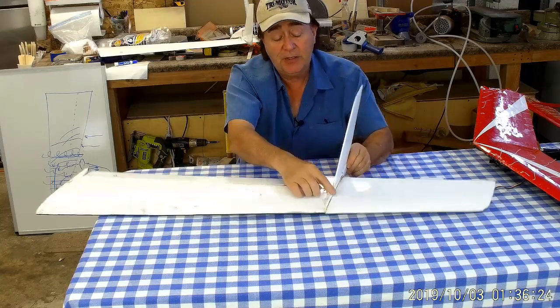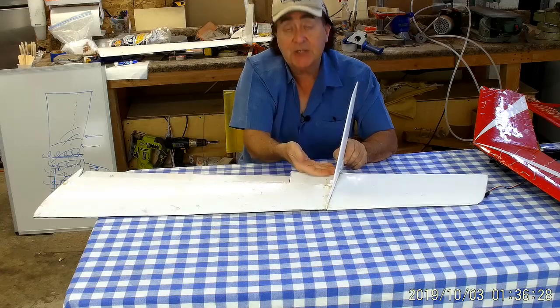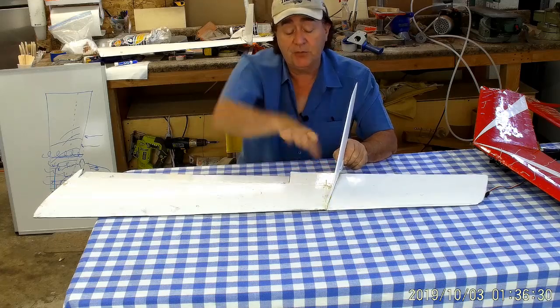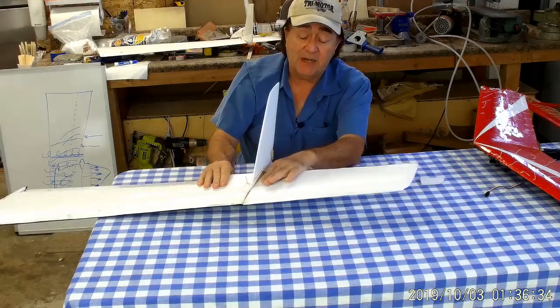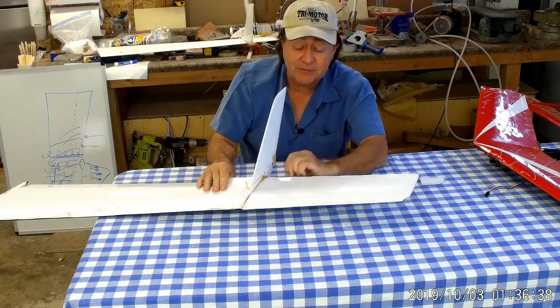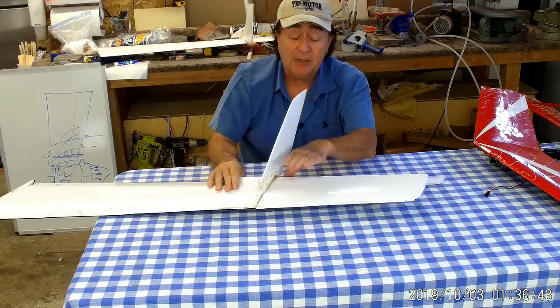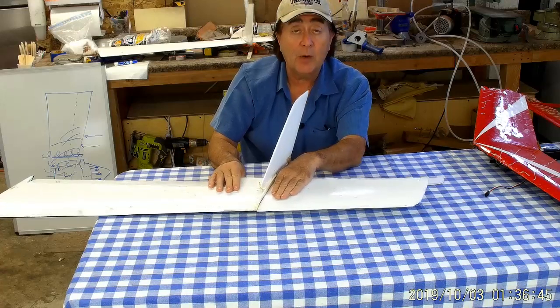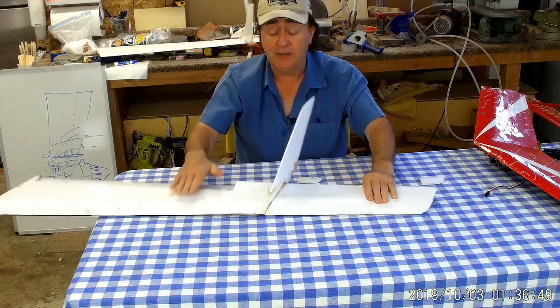So when this winglet mount gets assembled here, that fillet, the wing actually slips inside of it and prevents the wing from rotating, prevents the mount from rotating. And likewise, on the outer panel, when this panel comes in, the aft portion slips inside those fillets that are top and bottom, and they provide a structural stop and keep this wing panel locked in place, and helps transfer the torsional loads from out here into here.